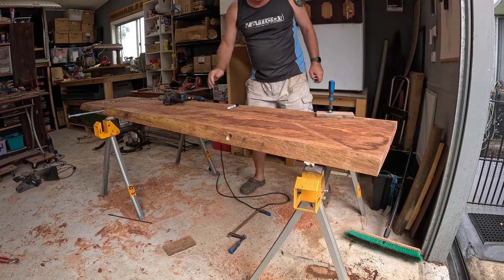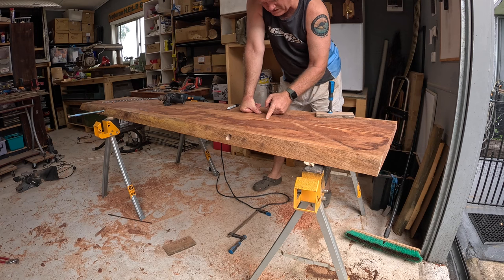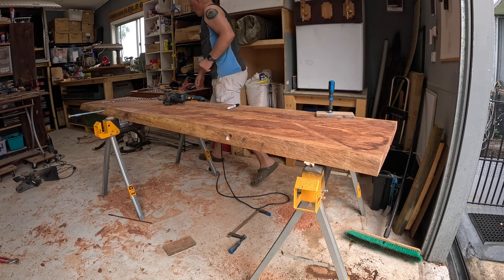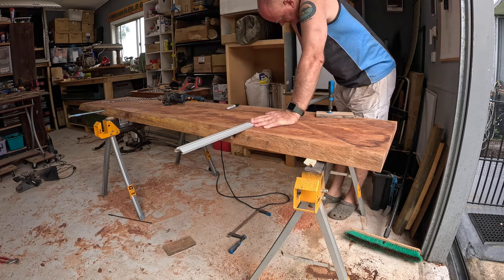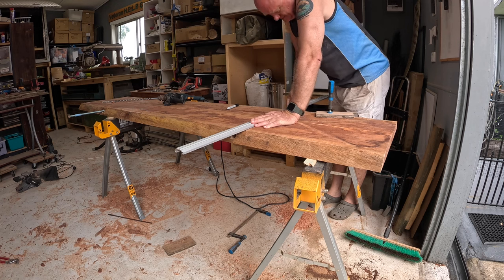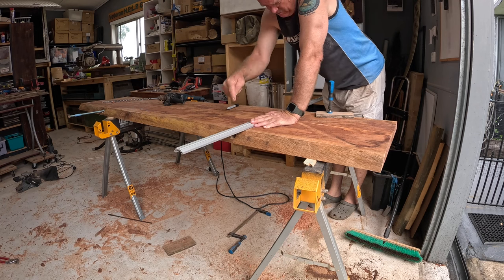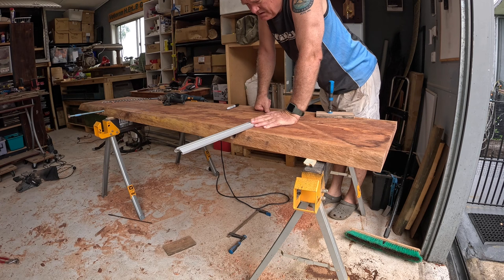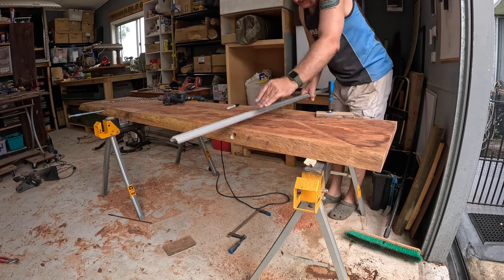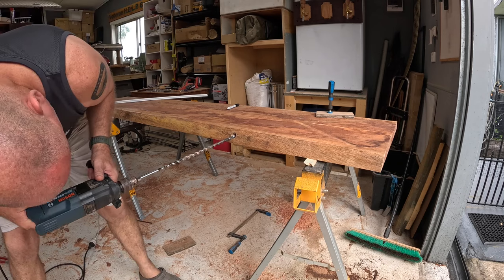Tell you what, I'll get a straight edge and see if my two pockets are in line with that. And to be honest, by eye it looks pretty good. Oh, now I would say any tunneler would be delighted with that alignment. That's just about spot on to the center of each hole there, there, and there. So I think I will come in from that end. And I think keeping it a bit below horizontal was a good idea.